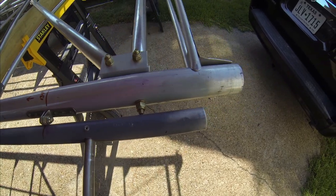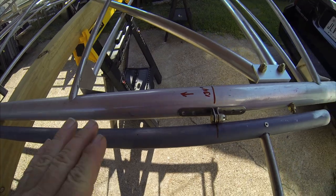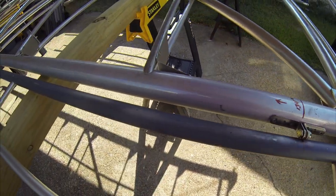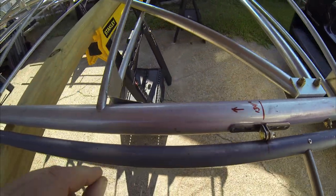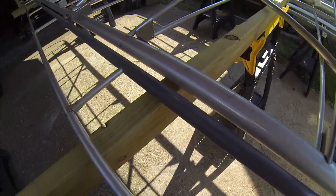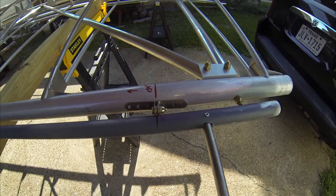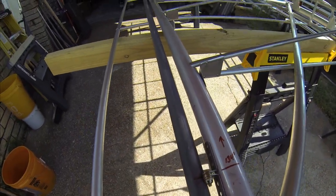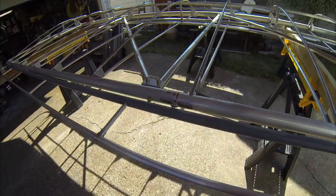I'll score a center line down here that I'm going to drill and rivet with the 3/16 rivets to the spar, so these will stay in a line. I'll place a board underneath across the entire length and drag it down to score that line — I touched on that a little when we were doing the ailerons. I'm going to get everything set up and ready, and I'll come back and show you what everything looks like once it's together.